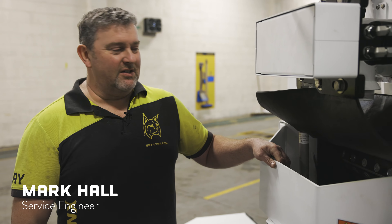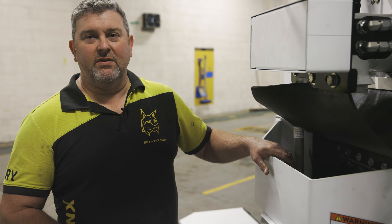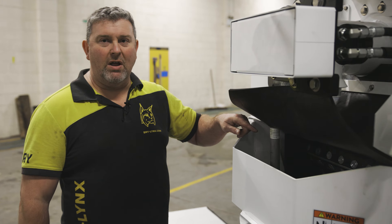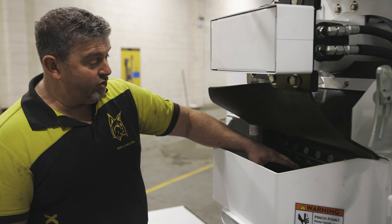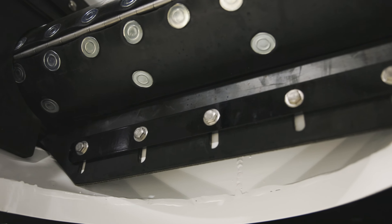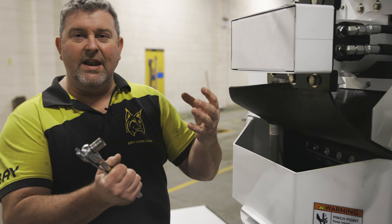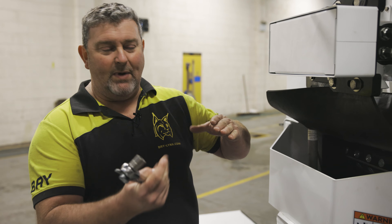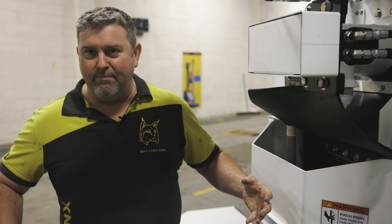Hi, it's Mark from Baylinks and today I'm going to speak to you about how to and the importance of adjusting your belt scraper. Your rear belt scraper is located inside your mixing bowl and it literally touches up onto the underside of your belt. The idea is that as your belt's coming around, any residual bits that haven't dropped into your bowl get pushed off the belt by this, and it stops material carrying along the underside of your mixer and leaving a mess on the road.